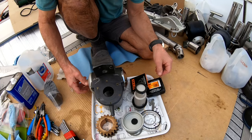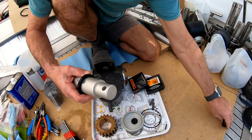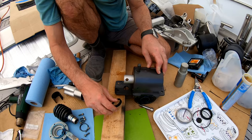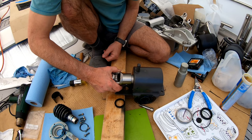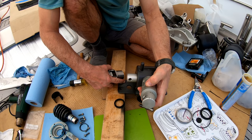And then next will be the motor for the mainsail furler. So I have all the parts here, the bearings, new rings. I got a new shaft because the last shaft here was very pitted. So previously, this old shaft came out the top of the motor like this. And when this is on here, there's a big gap around there which let all the water in, which was pretty pathetic, right? And that's what caused all this damage around the aluminium at the top here on the shaft, which then presumably let more water in because it got past the seals.